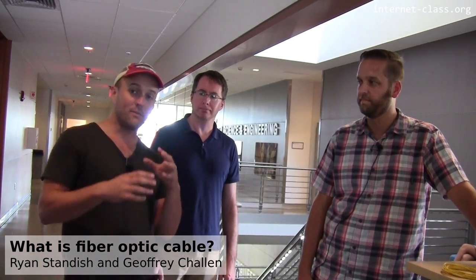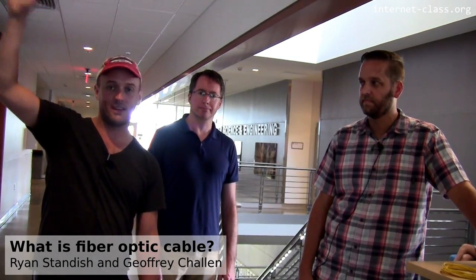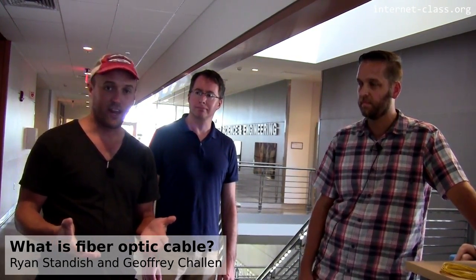All right, so we followed the cable. We started the cable in my office, and we followed it all the way into the networking closet, right? And at some point, those copper twisted pair cables that we looked at, the signal that we run through them just sort of runs out of steam, right? So at some point, you send in a signal at one end. That signal gets weaker and weaker as it goes, and so at some point, we run out of cable. So for the copper cables that we started with, that's about 100 meters, right?